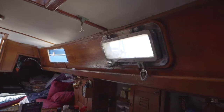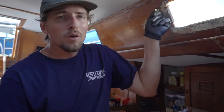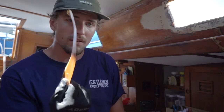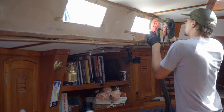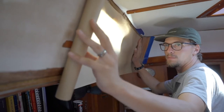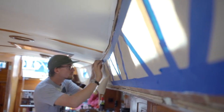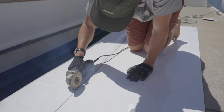Moving inside, we had a lot of work to do. The old cabin side was made out of teak and it just really dated the whole boat. Right off the bat, we wanted to do something white. This material is almost like a wallpaper — it's not plywood. It's a super thin, razor-thin teak with almost a cardboard texture on the back. At first I had thought about repainting it in something like Awlgrip, but Awlgrip is very expensive, and in order to get as flat of a look as I wanted, it was going to require a lot of fairing. So we decided to use Formica — a countertop laminate made out of fiberglass. It's really tough stuff, and I wanted something that was going to last a long time. We were able to cut and individually put them up on the side of the wall, and in one day the entire sides were done.